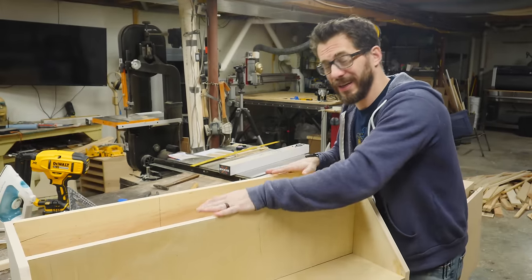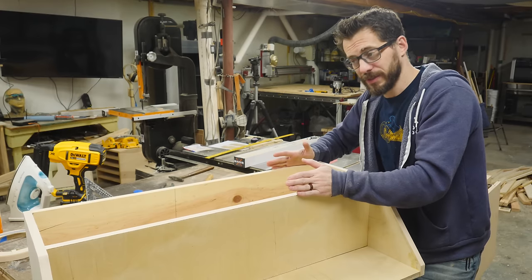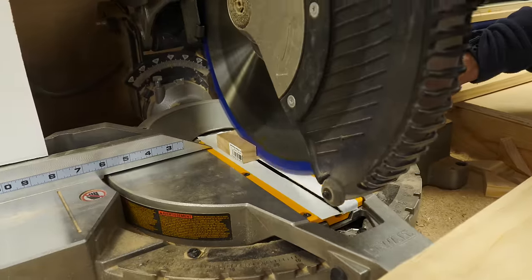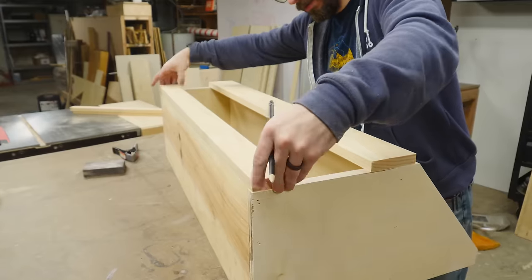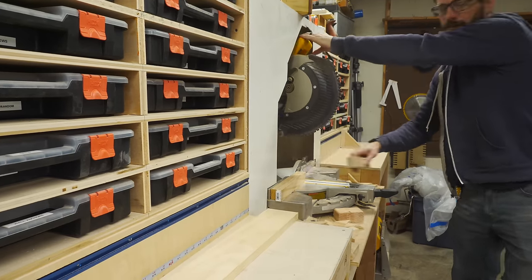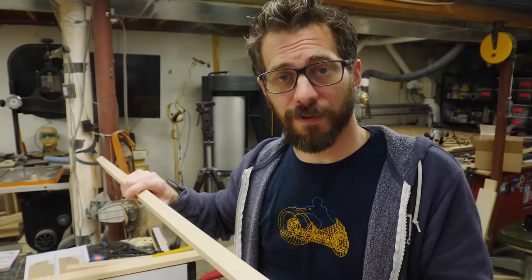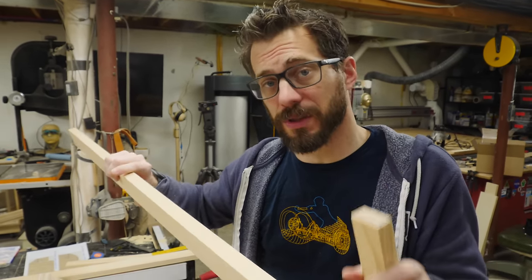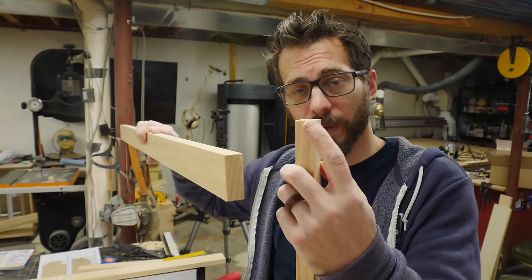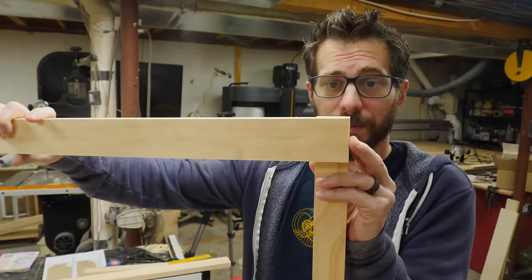I got all the edge banding put on and ended up going ahead to cover all the surfaces because it looked better. Next we're going to make the door, which will be made out of a one-by frame put together with half lap joints. One of the cool things about using a half lap for a frame is that you can cut all four pieces to the full dimensions of your frame — you don't have to have two sides that are shorter. The way it works is you cut away half the thickness of both pieces so they fit together overlaid at the corner.